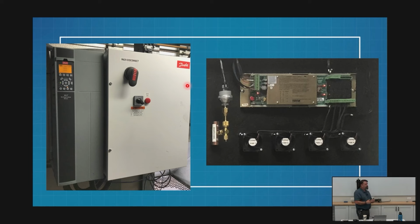If we don't do that and we don't keep the header end hot, we tend to log oil. That's the issue. If I have a fan out on a condenser, I could be logging oil right there. I don't have a nice even temperature through the condenser, so I'm going to attract oil. It's going to stick to that hot spot. So anyway, that's why we do that. That's why we stage it that way. This is the how.